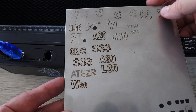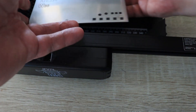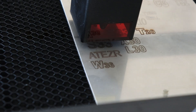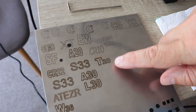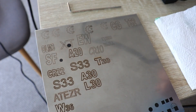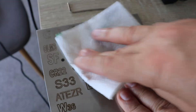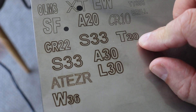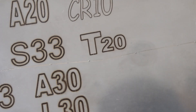Then engraving stainless steel — this is the same plate I always use, with engravings from 20W and 30W diode lasers for comparison. The speed is 200mm per minute, which I use with all stronger laser engravers. After cleaning with isopropyl alcohol, it is definitely engraved into the surface — not as deep as 30W diode lasers but much sharper. I illustrate this with an allen key — you can definitely feel it engraved into the surface of the stainless steel.